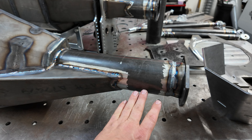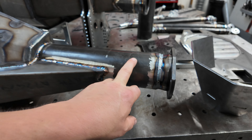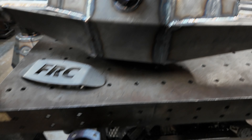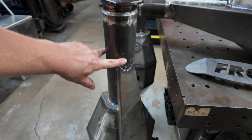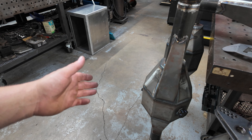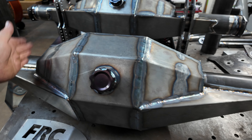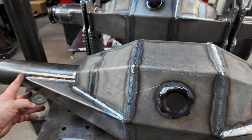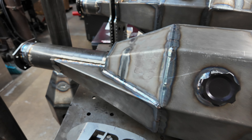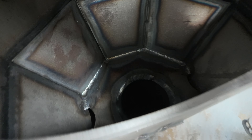With a leaf spring application, this pretty much means we don't have to notch our stuff to fit on the axle tube. This is an S10 one — it's pretty close, might still need a little trim. But the wider ones like this Chevy 2 length — there's enough room so the through-bolt perch sits there and we don't have to trim at all. That's another thing: if somebody buys this housing to do the project themselves I wanted to make it as easy as possible. You can see with this tube-to-tube width the tube isn't that long, and there's a lot of support with that double shear going on inside the interior bulkhead.